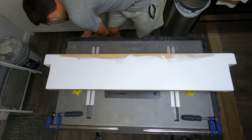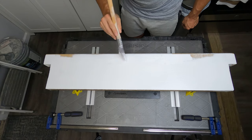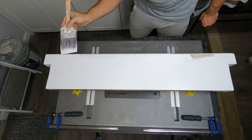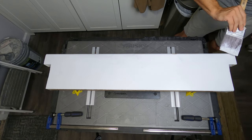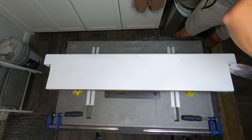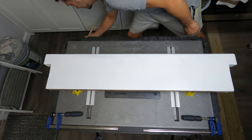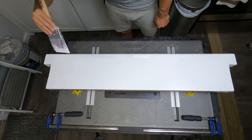We need a little bit more paint along the edge here. I'm not going to show painting the back side, but what we have this on are little painting triangles. These work great but they do have a flaw: if you're painting something heavy such as a door, they are small enough that they will actually imprint into the door with their tips. So keep that in mind — if you're painting something heavier you might just want to use a flat surface and wait for it to fully dry before flipping it over. Otherwise you might have small dots in your door. I know this because I did it — it literally dented the door. It was a cheap hollow interior door, but it's still annoying.